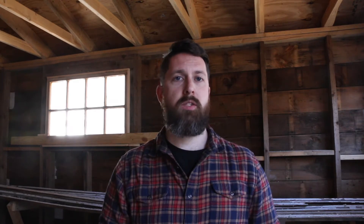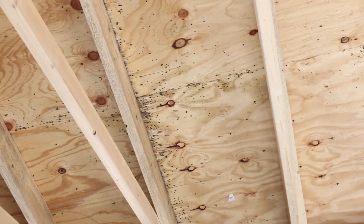When we first started the process of roofing the shop — putting the decking on and then getting the shingles done — I think it was end of November, early December of last year, and it's now the end of March. In the last week or so I noticed that on the inside of the roof, so the underside of the decking, there's some mold forming. I think that's because where the shop currently sits there's a lot of moisture — the water level is pretty close, it's high moisture content in the ground. I also don't have a floor in the shop yet; I'm going to have a brick floor, so right now it's just gravel. All that moisture can rise up and with the windows and door shut all the time it just holds that moisture in. So I need to figure out some sort of venting system. In the meantime I'm just leaving the door open to let things air out, and moving forward I'll probably come up with some sort of solution and put that into a video.